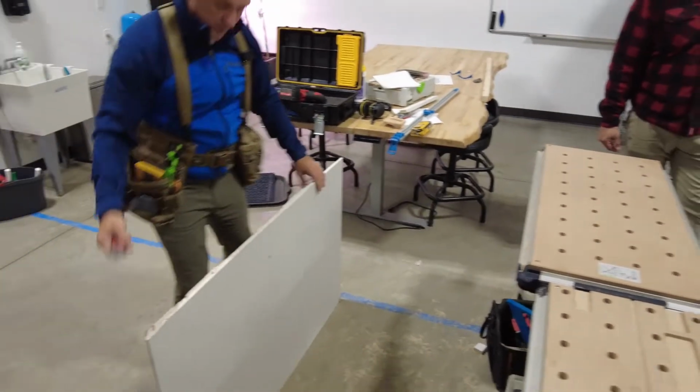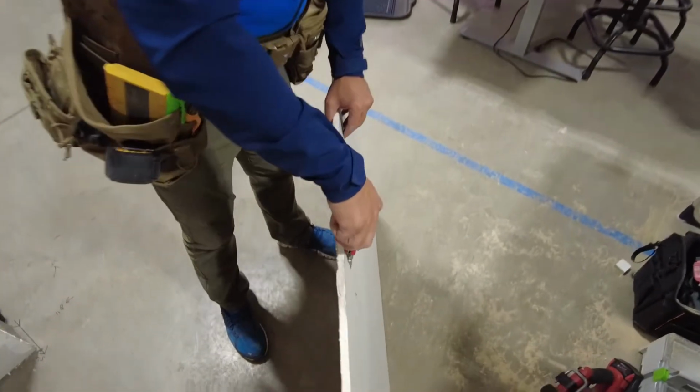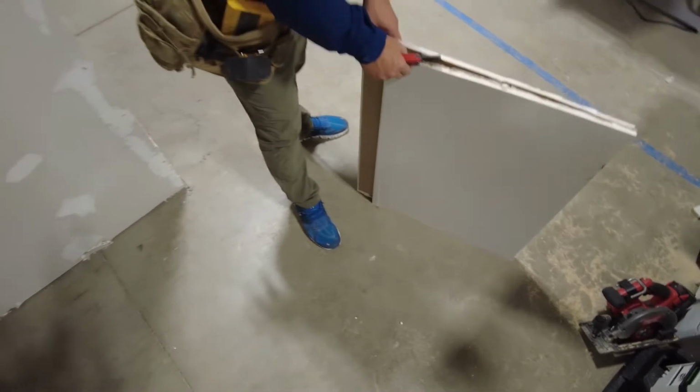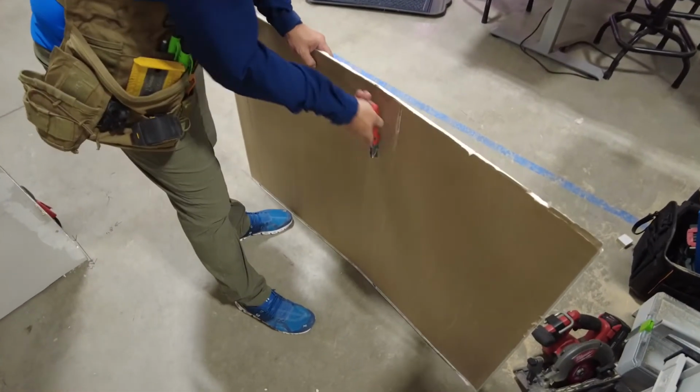All right, now you cut drywall. You score this, maybe go from the top here, Dennis. So you score your paper, put your knee into it, cuts back. The more you bend it, the straighter it's gonna be. The reason I say that, if it's here and I score the back, I can be crooked, right?